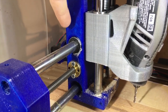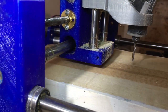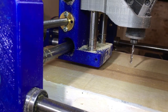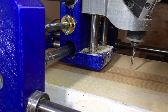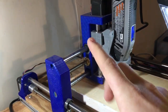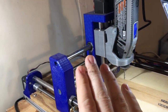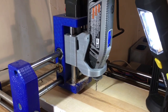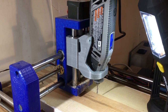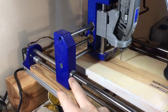I also added two linear bearings into the top part of the carriage. I tried doing it on the bottom as well but it wasn't cooperating very well, so I ended up with two on top and one on the bottom. Even the two on the top really helped — in the beginning when I only had one on top and one on bottom, my entire carriage was sideways, you could totally see it. It's light years better with the double bearing, so I really recommend putting double bearings in everything.